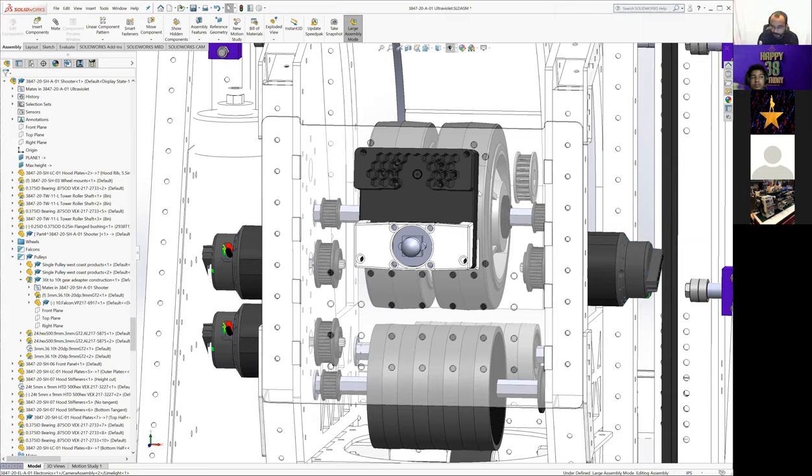So by making our motors run efficiently when they're just free spinning, they get a lot of power to spin up. So they get up to speed very, very quickly because we're asking them to go to a speed that's in the middle of their power band. And they have enough overhead power to stay there while the ball is coming through and trying to slow it down. So the motors are able to react, add more power, and basically say, hey, we're slowing down. The PID control loop is doing all that, increasing the power as the ball's coming through. And once that ball is fired and the wheel is unloaded, the motor is able to get it back up to the same speed as fast as possible.